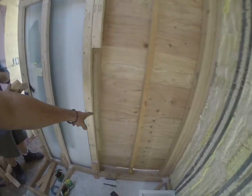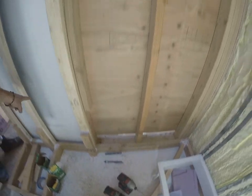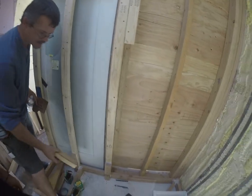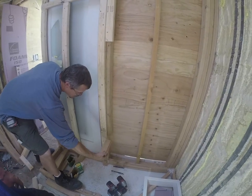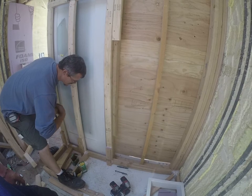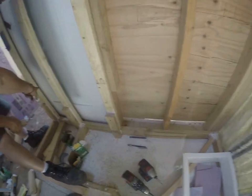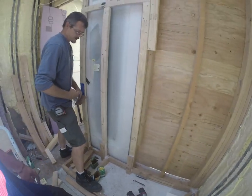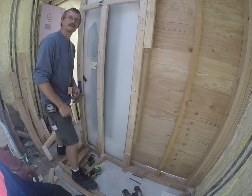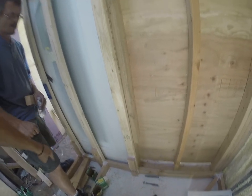So Jim, you're gonna run the gas line — actually the gas line is going to run up here, come out, and then 90-degree elbow, stop right here. And then this is gonna be cut down — yeah, it's gotta get all the way to here. Because that gas line is recessed, it's gotta come all the way to here with an elbow and then come inside.